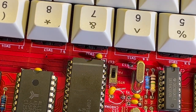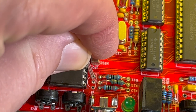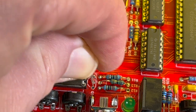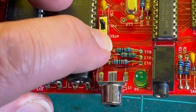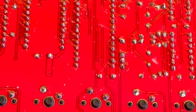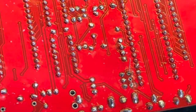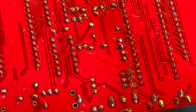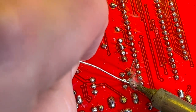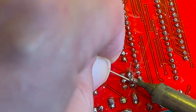Now, okay, it's definitely the right transistor. If this fixes the luma, I'm going to have to redo the 120 picofarad capacitor to couple the chroma back in.